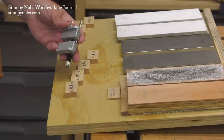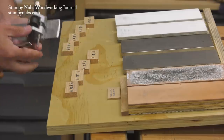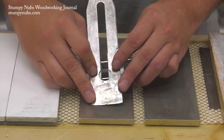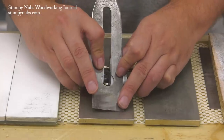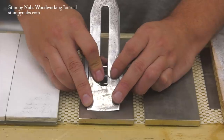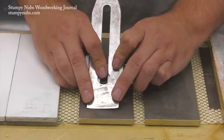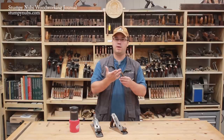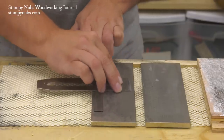When you finish, take your iron to your bench stones and install it in your guide. These inexpensive single-wheel guides work well for heavily cambered irons because you can rock them as you move across the stone. Begin with a thousand grit. Press down on the right corner of the iron at the beginning of the stroke, then shift the pressure across to the other corner as you pull the guide towards you. Take another stroke beginning with pressure on the left corner and shifting to the right. Repeat, going back and forth from corner to corner until the last of the blunt edge is gone and you can feel a burr all the way across the back of the bevel. Remove that burr with some light rubbing flat on the stone and you're all done.